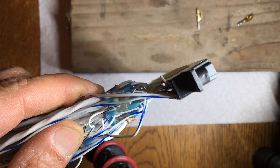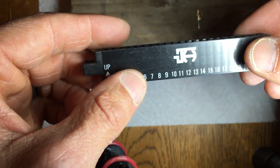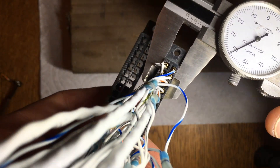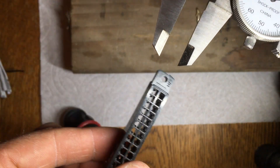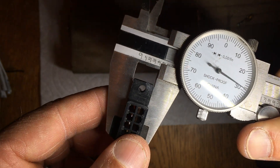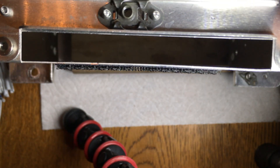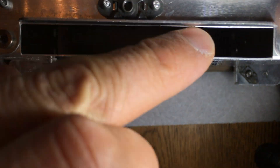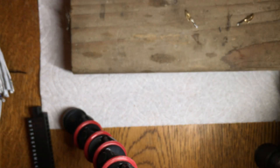If you have a connector that's absolutely ruined and want to replace it, I'll put the website in the description. The only other thing you'll need to do is file it down a little bit. The original Molex black connector is 0.36 inches thick and this aftermarket one is 0.43 inches — definitely thicker. So it may be tight fitting into your radio tray. You can either force it, file this surface, or file down the plug. I believe these are going to work well enough to clamp onto the circuit board on your radio, audio panel, or whatever you're working with.